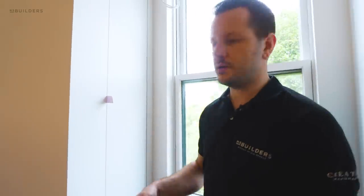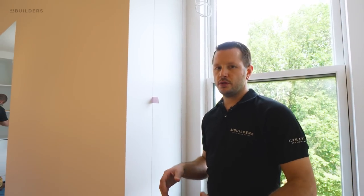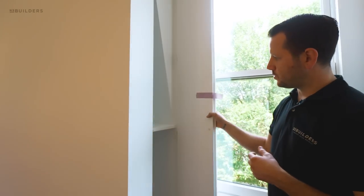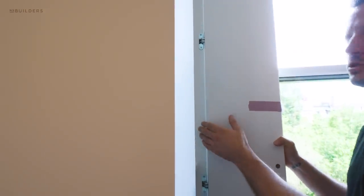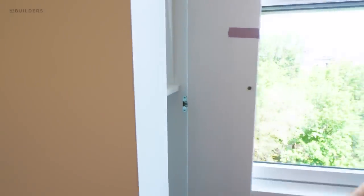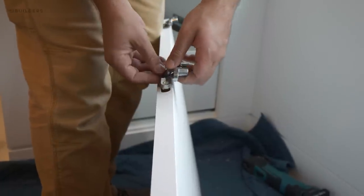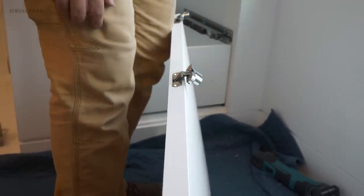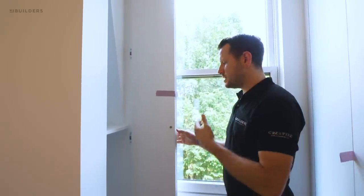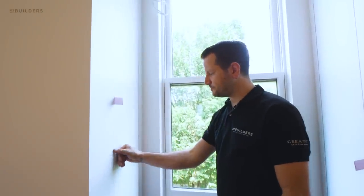So I had mentioned the hinges, and when we first built this project, the hinges were an issue. So we're able to get them to work on that side using a typical hinge, but this side, where it's so much closer to the actual framing for the roof, is where we ran into a lot of trouble. So what we ultimately ended up using were Salice hinges. This gave us the flexibility that we needed with the shallow depth of the hinge. It worked with our 1-inch thick doors, and it allowed us to get the reveals that we're looking for.